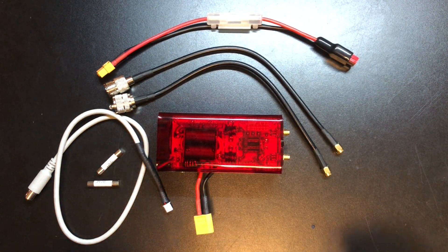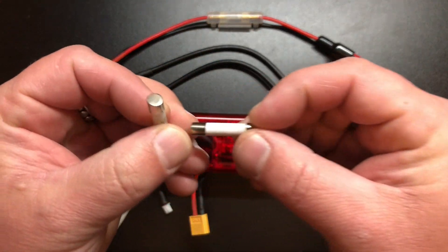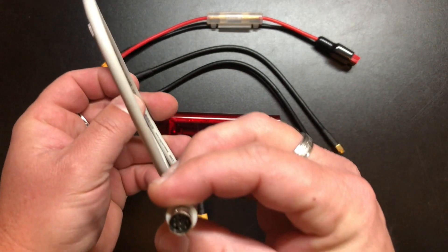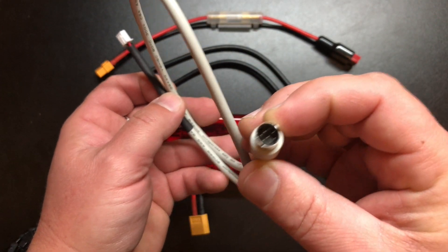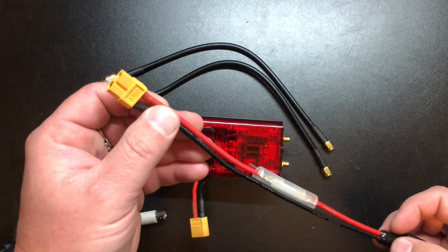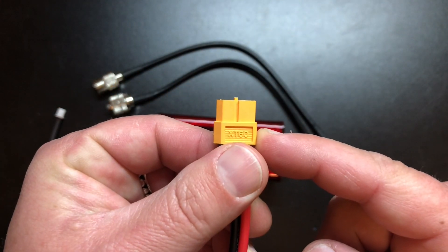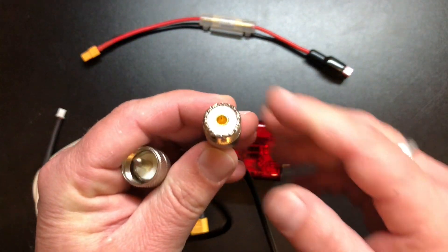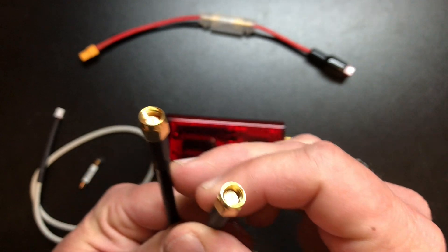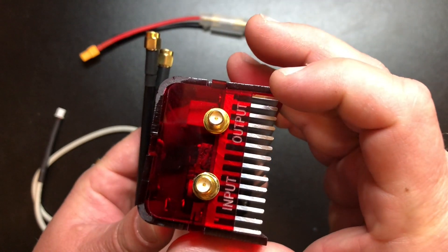Let's take a look at what we get. Obviously we get the PAX100. We get a couple extra fuses — these are 15 amp fuses. We get our cable to connect the 8-pin to the G90. This cable connects here for the PTT. We also get our power cord — it comes with just empty leads, and we put power poles on everything. It's got an XT60 connector here. And then we have a SO239 and a PL259 for attaching our radio and antenna, and those both have SMA male connectors for connecting to the input and output of the amplifier.